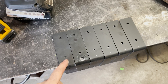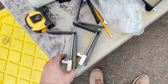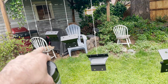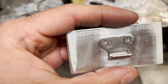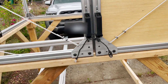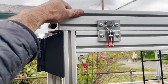Getting my brackets all sorted. I bought some clamps but they were too small for what I needed, so I got these big steel angles instead. These are all clear coated and now these are just hit with their second coat of black. I'm in the process of making brackets for my little latches. These clamp down and are going to be handy to keep the doors from bouncing up and down when I'm driving down dirt roads. Two will go there and one will go here to keep the pop-up down too.